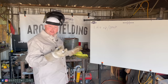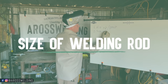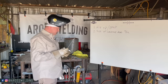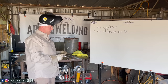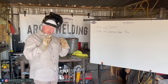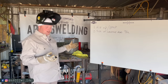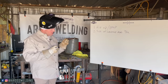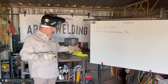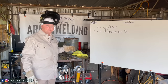Number two is the size of welding rod. The number one size I recommend is 3/32 in diameter — that's going to be your best bet when welding on thin material. The next size up that will work is 1/8, it's just a little bit bigger. As far as the type of rod, I've got 6011 here, but you can get 6010, 6013, or even weld this with 3/32 7018.